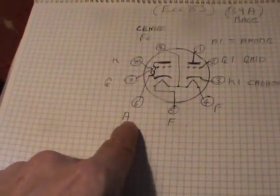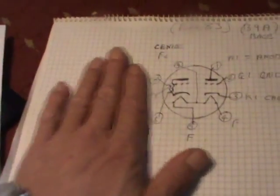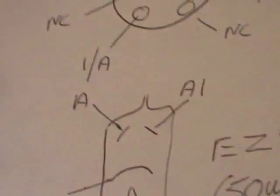This is the same again — you've got your anode, your grid, and your cathode, all just the same at this side with its own heater. That's what I made for the rectifier there — that is for the EZ-80, although I've used an EZ-81. That's a diagram of the tube, you know — filament, filament, cathode, and then your two anodes where AC comes in. And there are the pin connections.